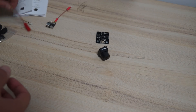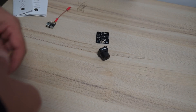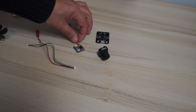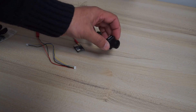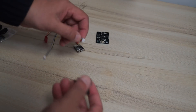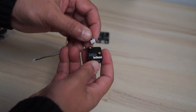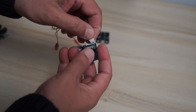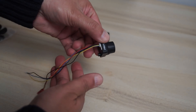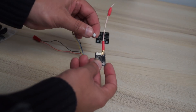I have installed a JST connector because that's how I'm going to power it. The video transmitter takes 5 volts maximum, but the Firefly camera can take from 5 to 36 volts. Basically the camera then provides power to the video transmitter, giving only 5 volts out from the camera. The connections are really straightforward and easy — this side connects to the video transmitter.